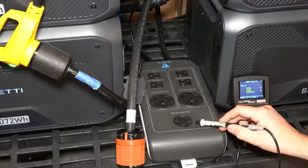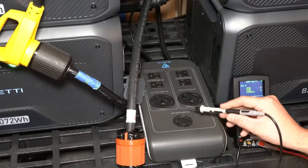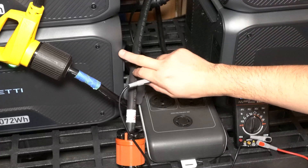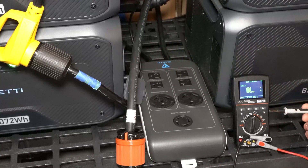This L14 here is my 240 volts that would go to my transfer switch, so I would expect that this ground cable would eventually lead back to the slave and back to my master unit. Well, it doesn't — and that's what I was a little surprised with. When I checked with support, they actually said it was by design, and I really don't know why you wouldn't do that.